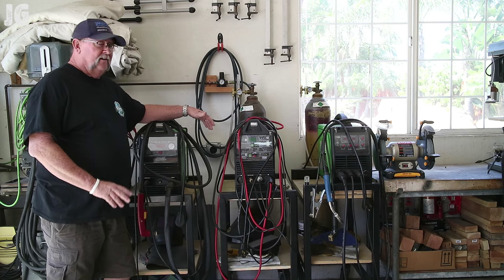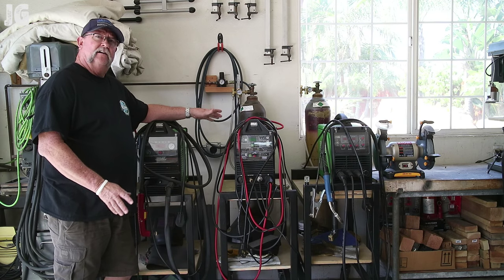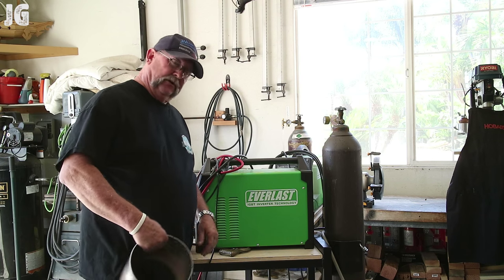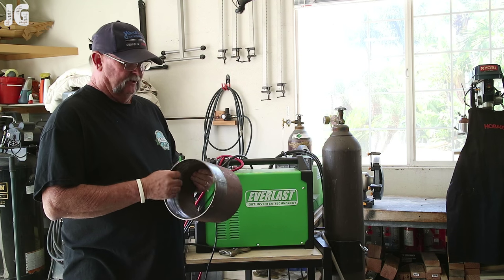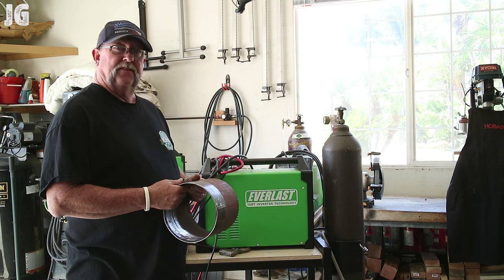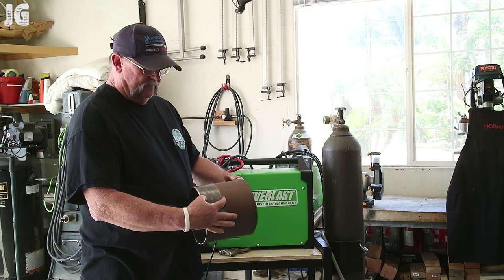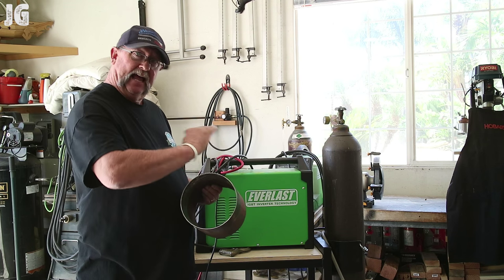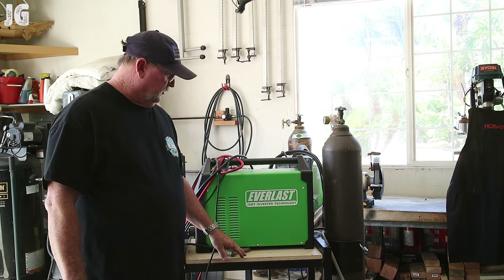As they say, there's a lot of different ways to skin a cat, and I finally decided this is the way we're going to do it. I found this piece of eight-inch diameter, eighth-inch thick wall scrap pipe laying around the shop. I thought I would cut it with a plasma cutter about two and a half to three inches wide, cut the whole ring off, then cut that ring in half so I have a half-round. The frames are made out of inch-and-a-half square tube.